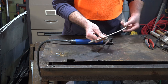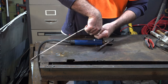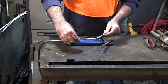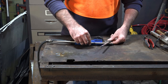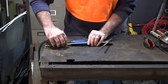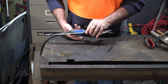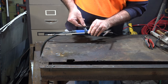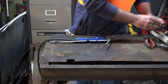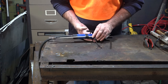So here we have it guys — the end is pretty ugly, but we'll see if it works before we get too carried away. What I'm going to do is stick it under here like so, follow it down the old torch like that. I might bend the end of it here so we get the same shape as the electrode — just put a slight kink on it so it follows the shape of the electrode. Beautiful, and like I say we can move the electrode up and down. Using a very thin pipe means I can bend it to the same shape — I just want to see if it works first. So that'll hold it there — a couple of zip ties. I love zip ties, they're good, you can do anything with them, and they're easy to get off when you need to.